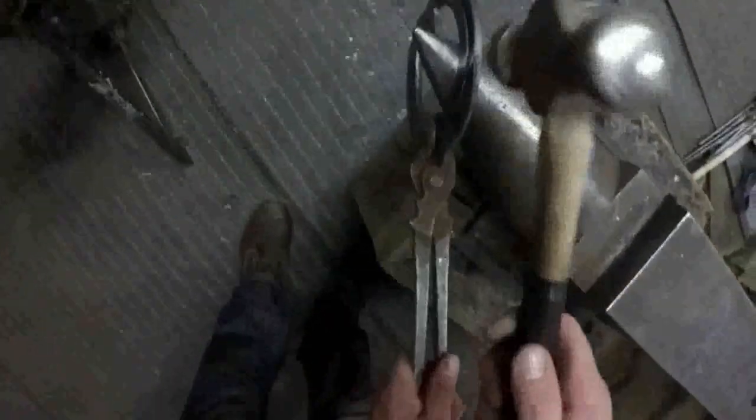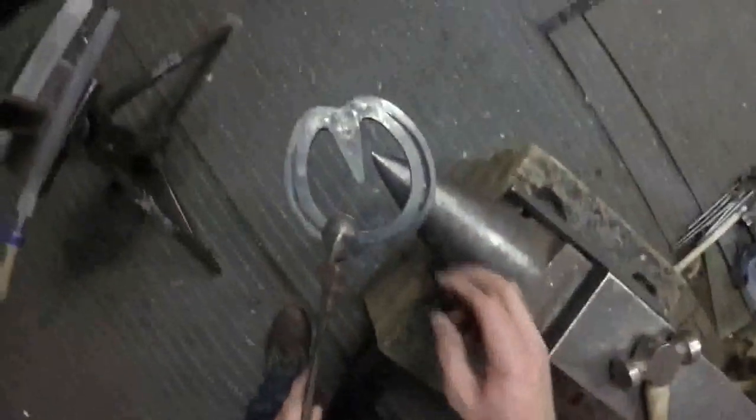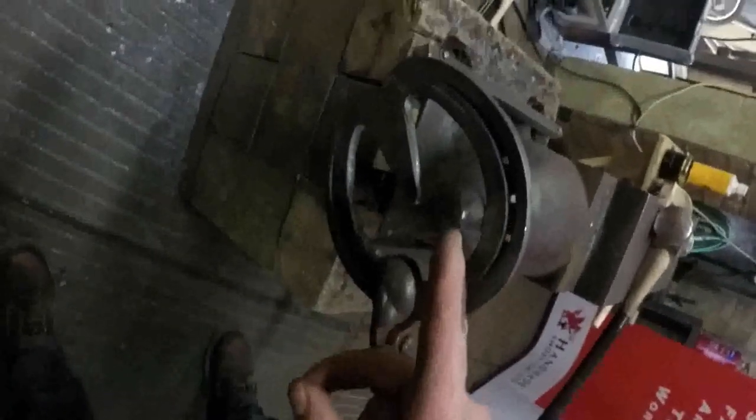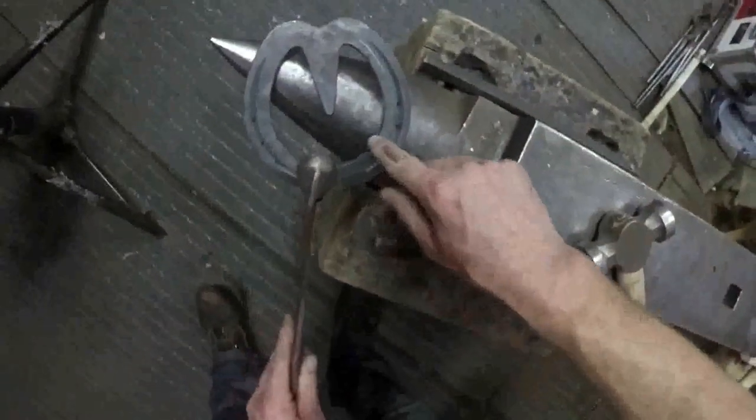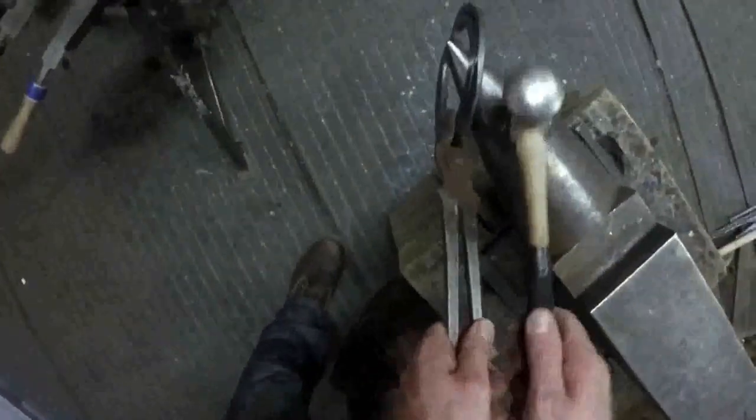Before I fuller it, I've got to knock the fuller edge off. So unfortunately when you've got a frog plate, you can only work down the pointy end of the bick. So don't work with your shoe just on a bick like that, because the bearing surface on that inside edge is tiny and it'll put little dents all the way around. If you twist your shoe around, it increases that distance there, just fractionally, so the bick puts less stress on there, it doesn't dent the inside edge quite as much. So I'll just fuller an edge off there, all the way around, right up to the heel there. You see how that heel fits in perfectly onto that bick there. It'll just make it all real nice and round and smooth.